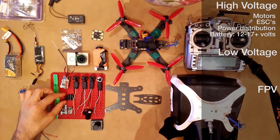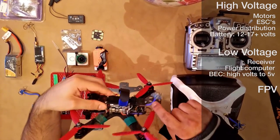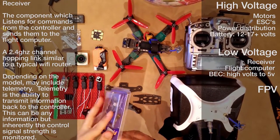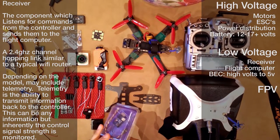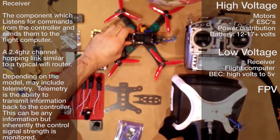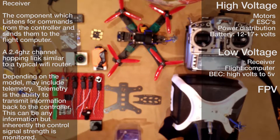The next system is going to be your receiver and flight computer. The receiver — which you can see over here — takes commands from your controller, and then it sends those commands to your flight computer. On this craft, the flight computer is going to be right on top there. The flight computer interprets those commands, decides what you're trying to do, and sends that information out to the ESCs that go to the motors — and that's how the thing stays in the air.